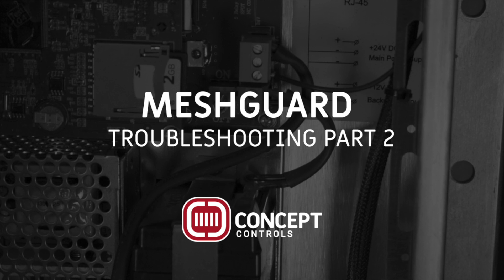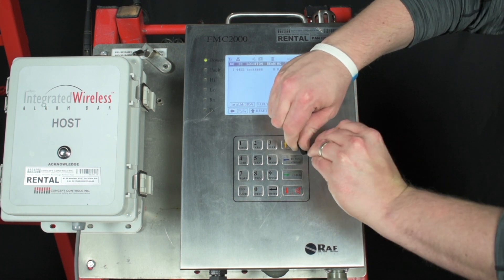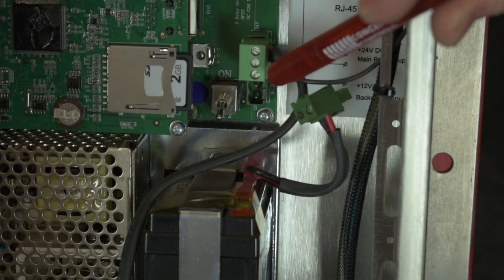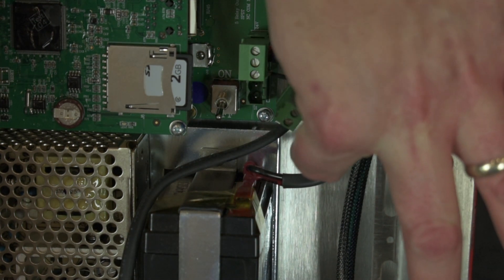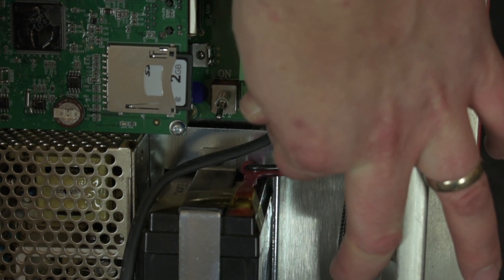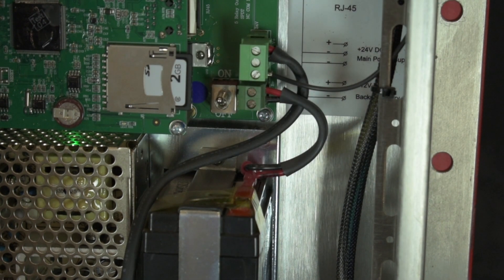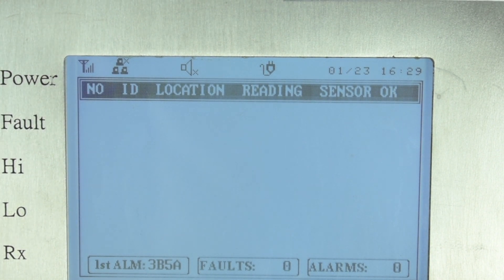Part 2: FMC Battery Issues. If you have a battery with an X through it on the top of the FMC's LCD screen, this means that the FMC is having issues with its internal battery backup. Open up the FMC door and inspect the FMC battery in the lower right-hand corner. Inspect both the battery leads and the PCB connection point. If any are loose or fell off, plug them back in while the unit is turned off. If connections seem solid but you're still getting the icon error, try changing the battery. If that still doesn't correct the problem, send the unit in for service. If everything is fixed and the battery is fully charged, the icon should turn into a plug as shown.